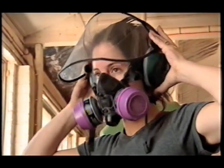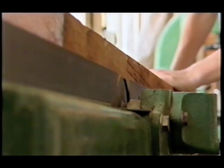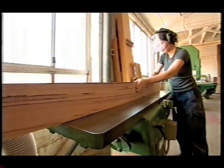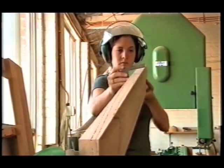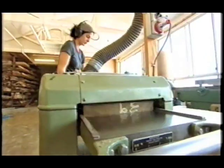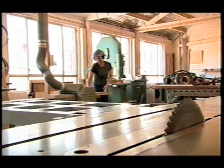The first thing I do — and it's quite an exciting part of the process — is to dress one of the faces. You can actually see what sort of timber it is that you've bought. The jointer is used to dress one face of the timber to a good, even surface, and then to dress one edge at right angles to that face. What you need is to get a really good 90-degree angle off the jointer. Once you've got one 90-degree angle, you can take parallel faces off that and you know you've got a true board all round. The thicknesser is then used to dress the opposite sides of a piece of timber parallel to each other. The end result is a board that is smooth and square on all sides.